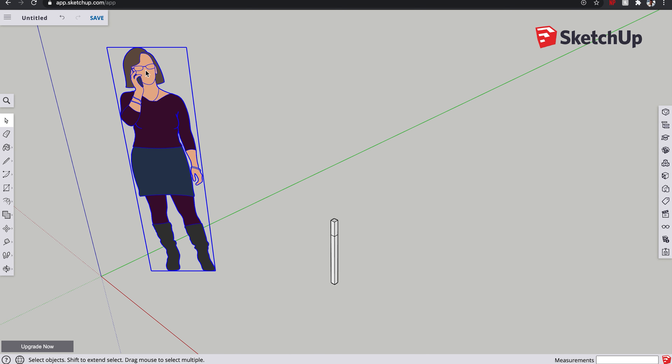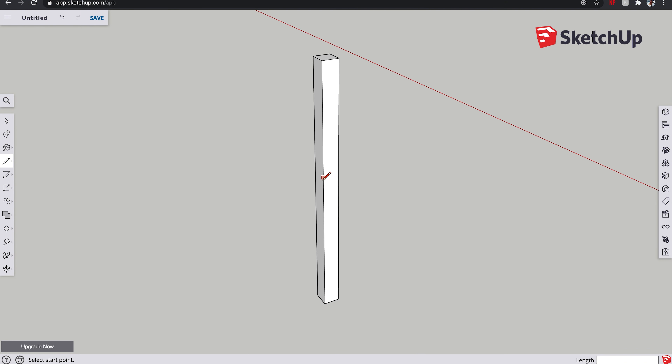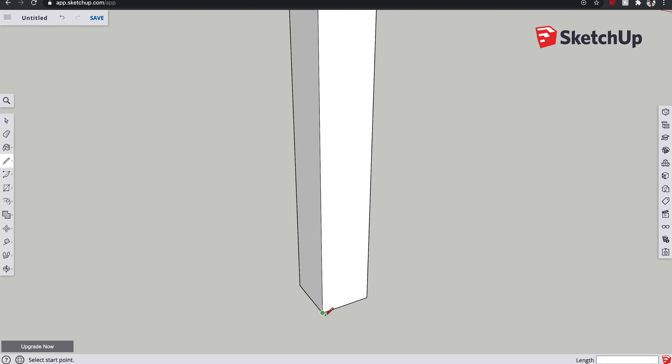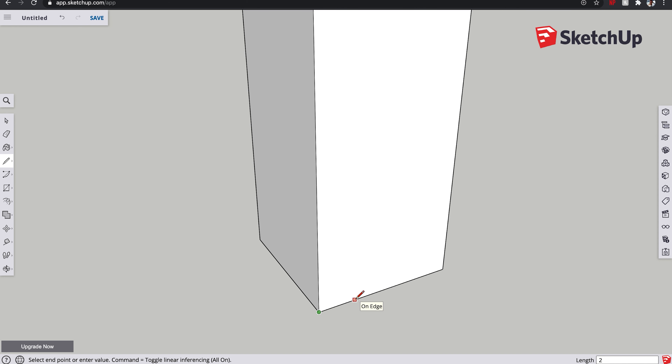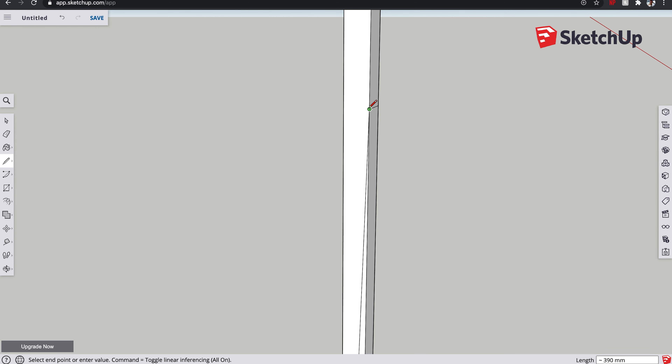Now let's get rid of the lady because we've got some sizes to work off. The foot of this leg is 20 millimeters square, so in total the leg tapers from 30 down to 20. But remember it's only the two internal faces that are tapered, meaning the square is going to be flush with the two outside faces. On the foot we're going to start on the outside corner and measure across 20 millimeters. With that end point we're going to connect that to the taper.